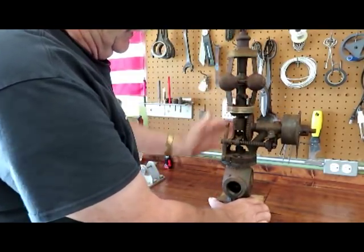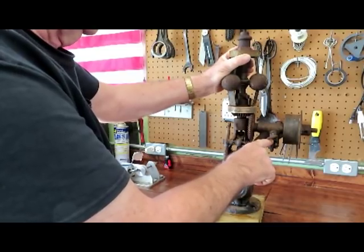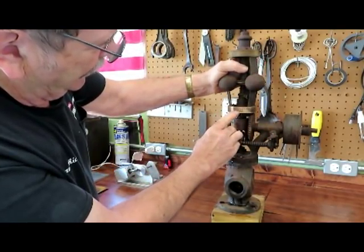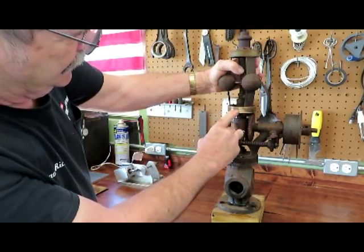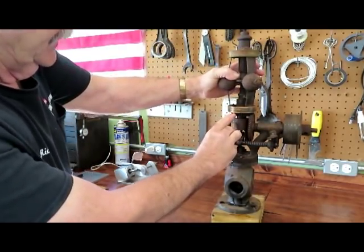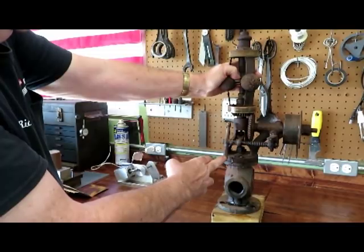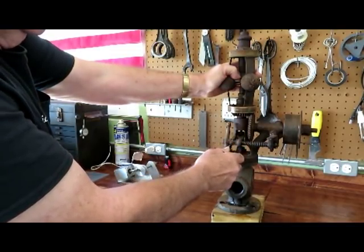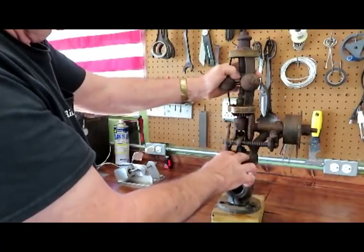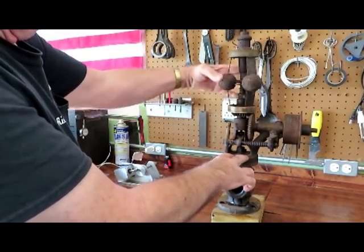And if you go back in the Google patents, you'll find a patent for that in 1906. Cleaned up the bands here where it normally just has the speed of the governor, and this one says shaft revolutions 350, and there's the serial number of the governor. But over here it's got the patents listed, and they're all 1906 patents. So a year later, 1907, the ball ranger adjustment was invented and patented by Pickering. And also the auto stop thing. So the only year this could really be is 1906. So that's how I'm figuring it.